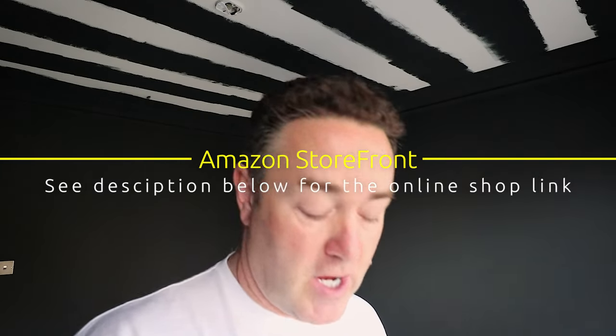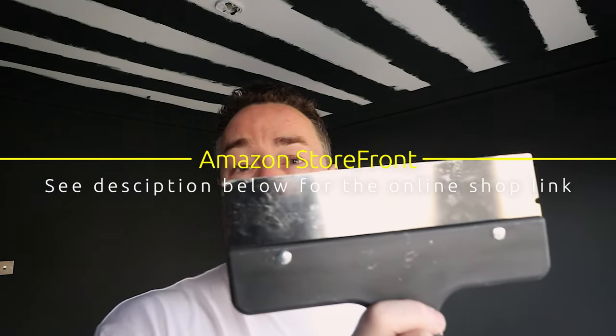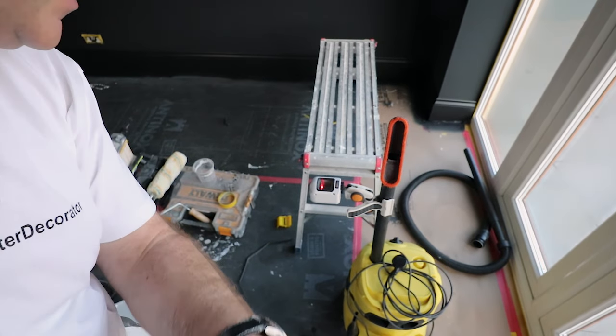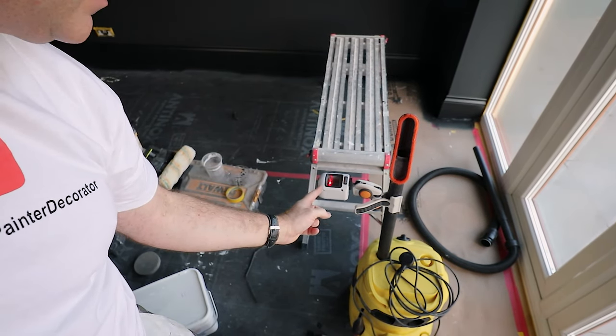Tools: I've got a hanging brush, I've got the squeegee, I've got a straight edge for cutting. I have got a pencil, and I have had a ruler to mark out where the 400 is across there. And I've also got set up there, pointing up, a laser liner that's gone all the way across that ceiling. I don't know whether you'll see it if I put the goggles over. I'm not sure, can you see that? It doesn't matter if you can't.